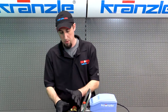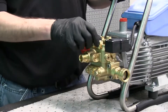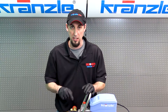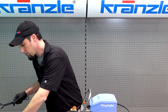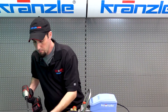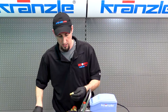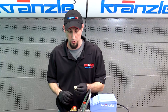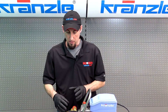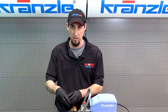With the pressure gauge removed, five of the six caps are identical — the exception being the one with the pressure gauge port. I like to remove that one first just to get it out of the way so I don't strip the hex on any of the other caps. That's going to be a 22-millimeter wrench. You can use an impact gun to remove them, but be very cautious — it's easy to cross-thread or round off the hex on the cap, both removing and installing.